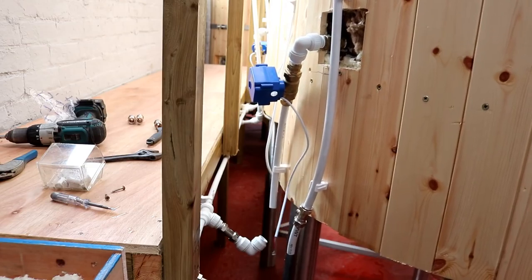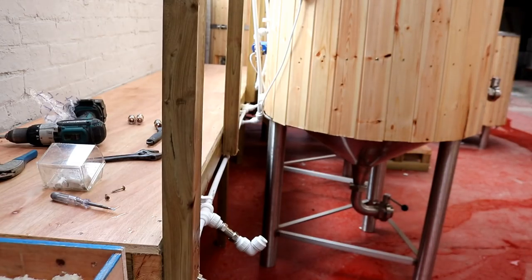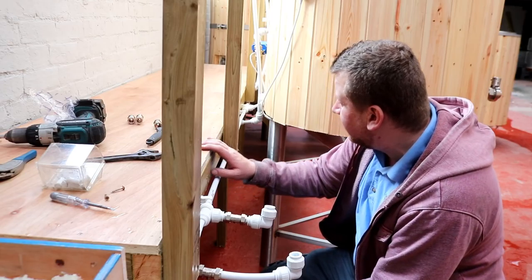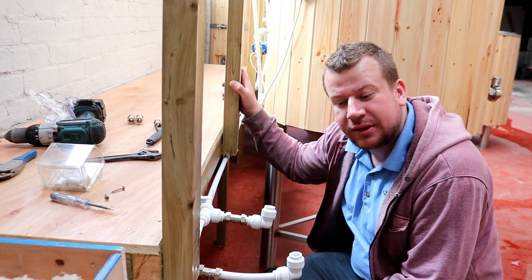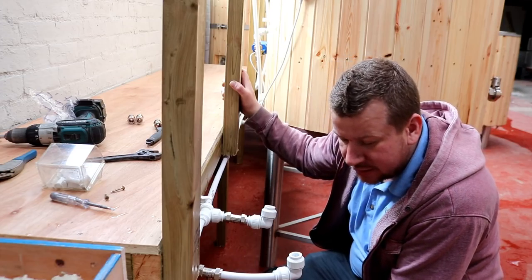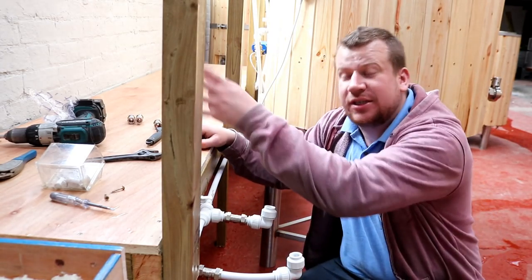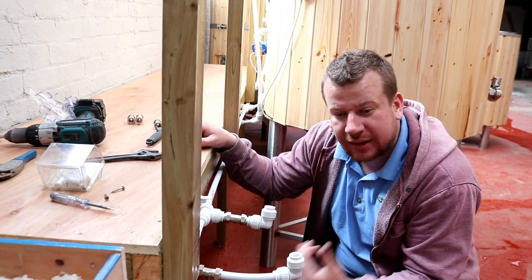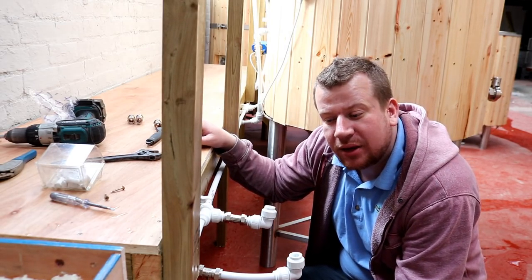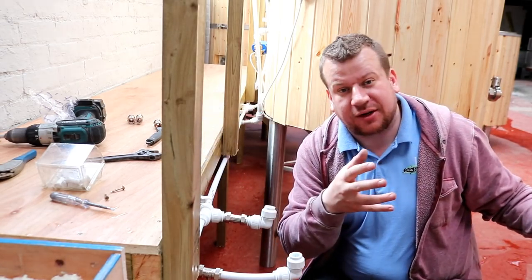All I have to do is crank up the fermenter, slide her out, and then we've gained access to the back, or we can do whatever we need to do to service it. While this is isolated, these tanks can still have product in them. I also want to make sure everything's modular — if we move premises in the future I can just disconnect and pull everything away. All the electrics for each fermenter are going to be housed on the fermenter itself, not a central control panel, so we can just pop them off, cart them away, and rig them up to another system if needs be. Very simple, very modular, very mobile — that's how I want to keep it. If we decide to change the layout I don't have to run miles of pipe, we just disconnect, drag the whole thing across, drop it down, reconnect — simple.